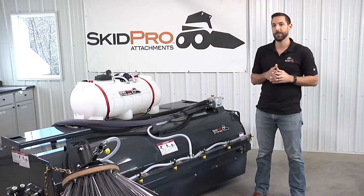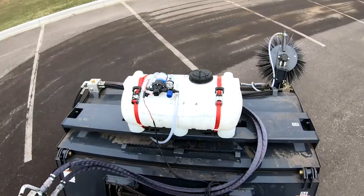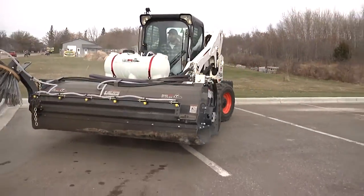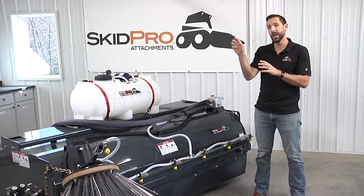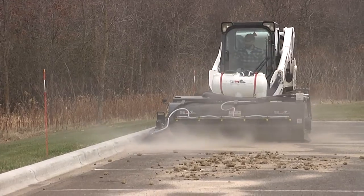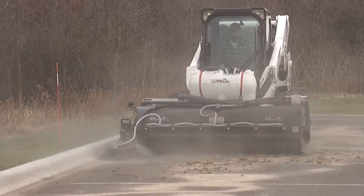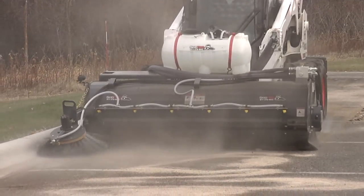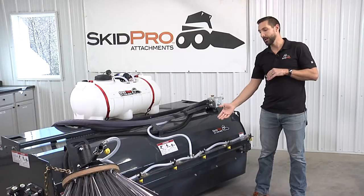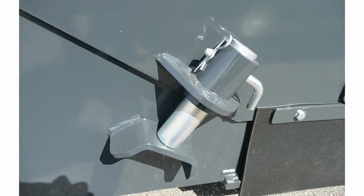The other thing that comes to mind for me is features on this broom. We do things a little differently than a lot of other brooms on the market. Most notably is the quick-set hood adjustment — it's tool-less, it's fast, and it's easy. Almost all other brooms on the market have an old nut-and-bolt type system. Those bolts are on the side in the dust, prone to seize, and you've got to find the right wrench and completely pull the bolt out as you adjust the arbor down as the bristles wear. With this unit it's simple: grab a forklift or a floor jack, raise up the hood, take out the quick-set pin adjustment — everything is pre-drilled — pop a pin, put it back in. It's just that easy.